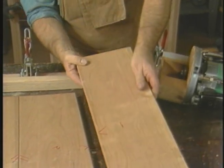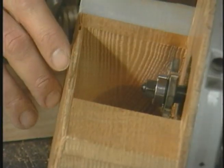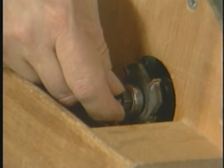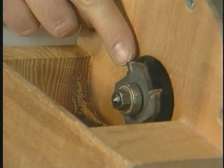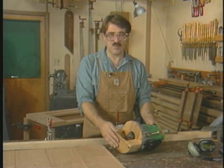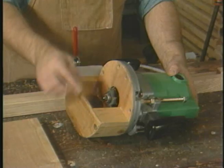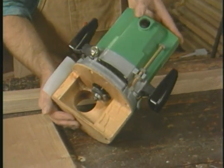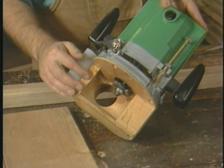Because the distance is only approximate, be sure to register the top of the board against the base of the router, and make sure the top of the board is plainly marked. The second thing that must be regulated is the depth of cut — the ball bearing does not permit the slotting cutter to go any deeper than one half an inch.